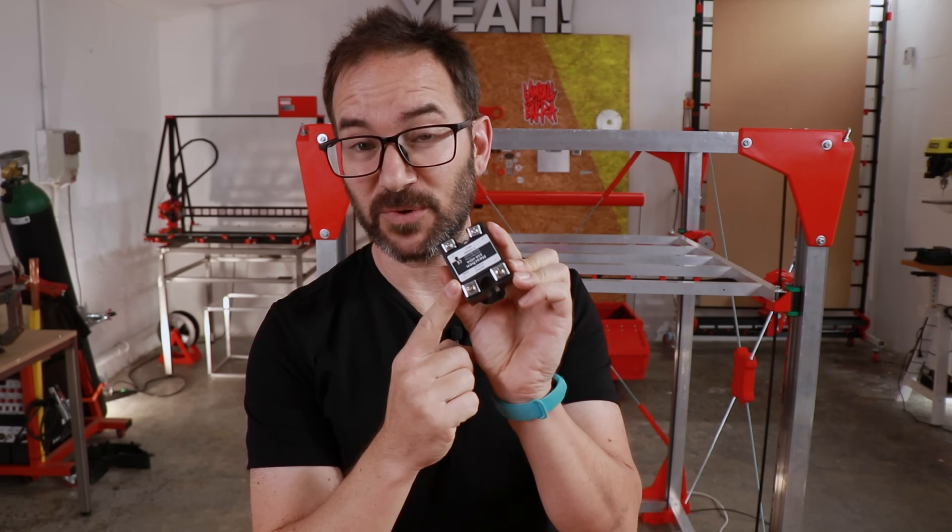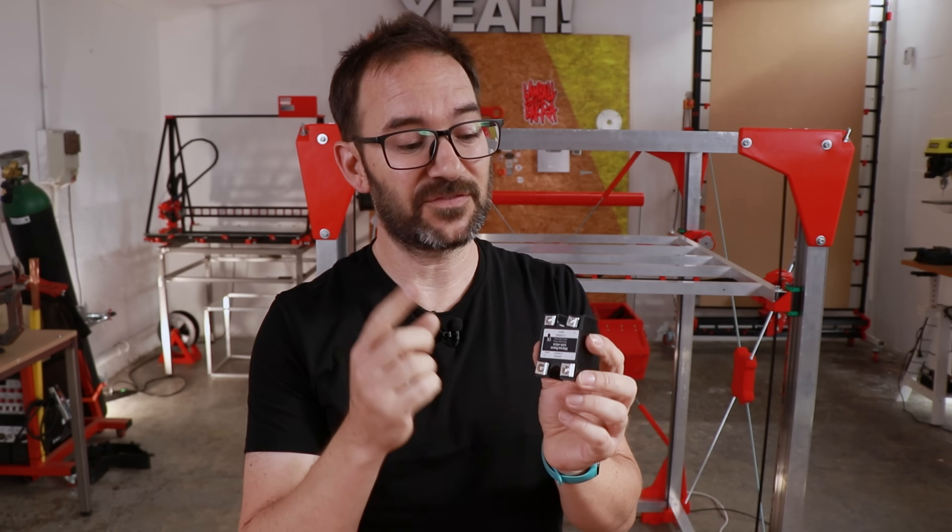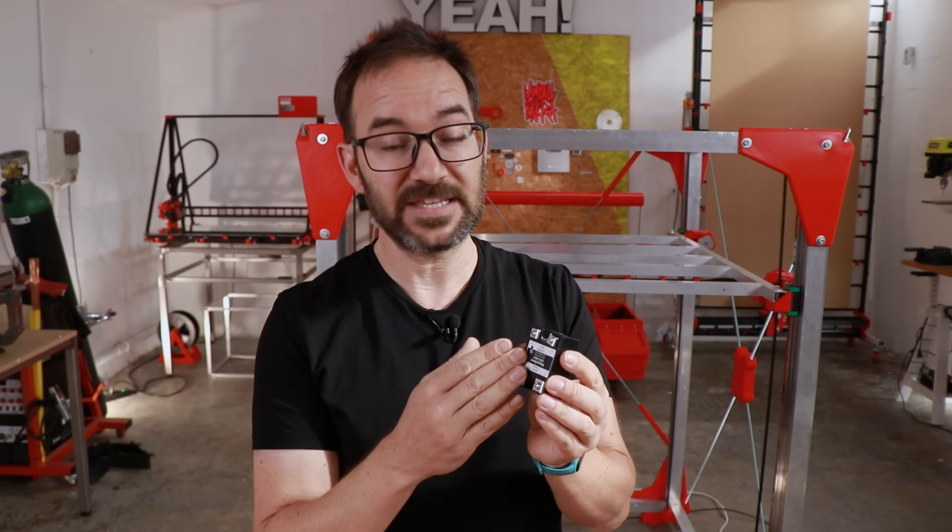We are going to use one of these solid state relays to switch on and off each one of the heating pads. Most solid state relays of this kind have a pretty funny way of failing: they stay on forever — they just don't switch off. Which means that if one of these fails, the heating pad will keep heating until it opens a portal to another dimension, until something catches on fire. But I have a solution for that too.